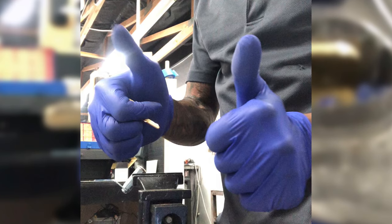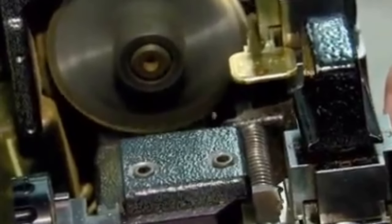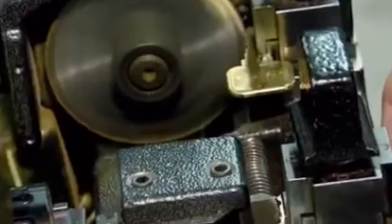Now you don't stop here. You don't want to use this key as your main key because you filed it down — it's thinner and it's weaker. What you want to do now that you've got that key is take it back to a locksmith, or if you've got the tools do it yourself, and copy that impressioned key onto a brand new key blank so that you've got a good strong key that works your lock. And that's it — that's how we make a key when the current key is not available.